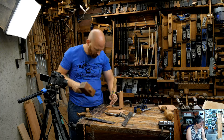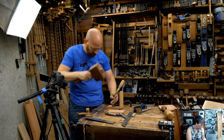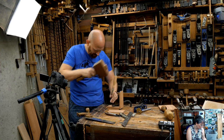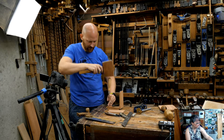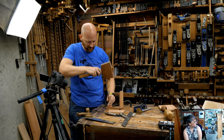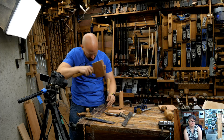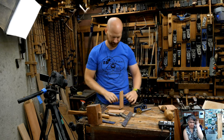But if you do have to open them up, you've got to get a better drill bit. A carbide drill bit will cut through it. But yeah, it's hardened. It ain't pretty. The other option is you can anneal the knife and then re-harden it, but that's a bit extreme and also lends itself to several other problems along the way. So I generally don't do that.